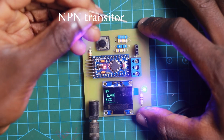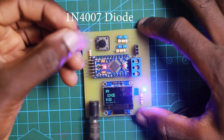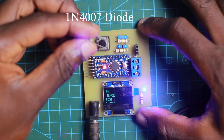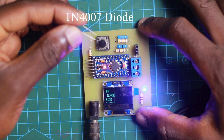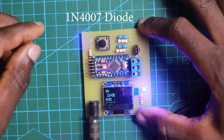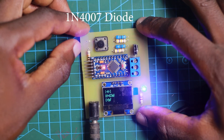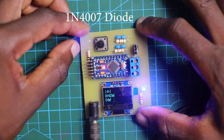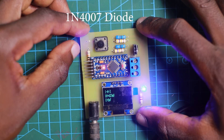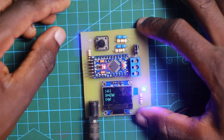Now let's use a diode — this is a 1N4007 diode. I'm going to plug it into the board. You can see how it automatically tells you which pin is the anode and which is the cathode. I plug it in and press the button. It tells you the diode is connected on pins 1 and 3, that the capacitance of this diode is 9 picofarads, and that the forward voltage is approximately 427–437 millivolts. I'd need to verify that value.